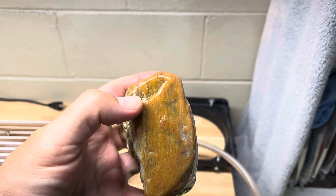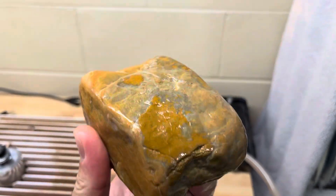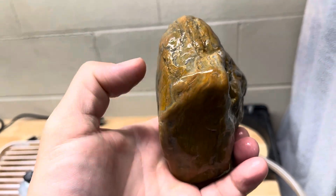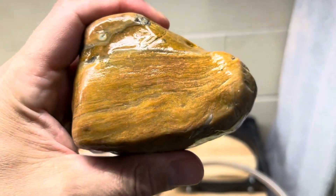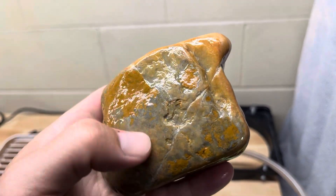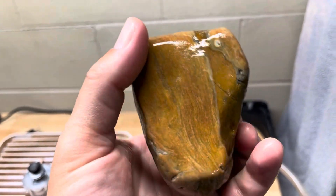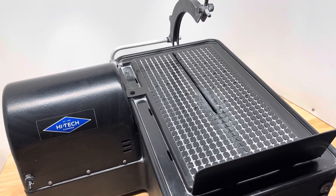So what I'm going to do is I'm going to cut a flat face here on the Big Saw, then I'll lay it down and cut a flat face on this side, and then I'll flip it and cut another flat face on this side so I have a totally perfect slab that's hopefully about an inch thick. Then I'll trace the circle on there as big as I possibly can get out of that piece, trim off the edges, and then shine it up. So first things first, I'm gonna have to get the big saw set up over here to make some big old cuts.